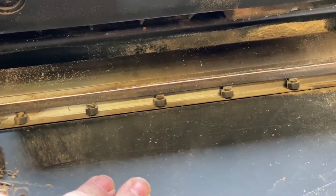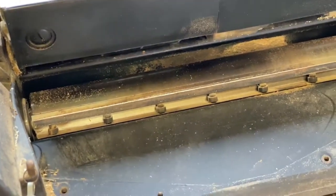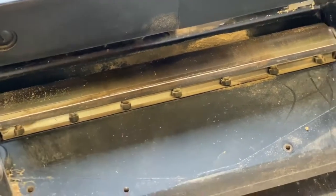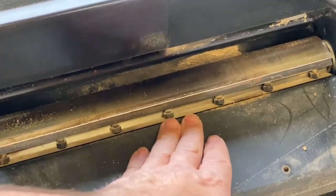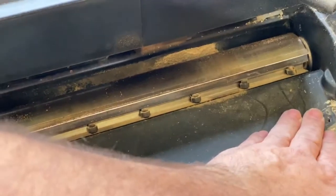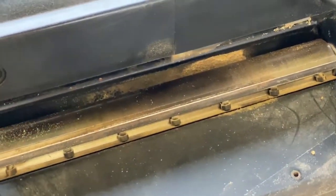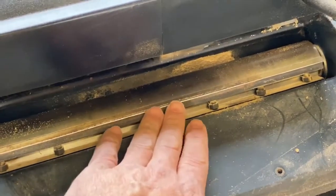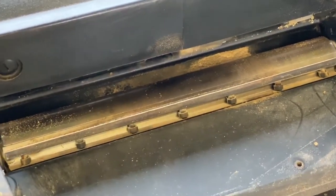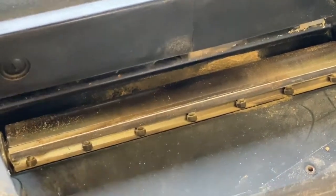And this is where potentially when you're sliding wood through the thicknesser, you probably should slide some here. Especially if you've got thin strips, don't always push them through the middle. But do one here, one here, one here, and just keep the process going just to maintain the wear on the blade. Otherwise, if you just put it in the middle all the time, you're just gonna have the constant wear. Obviously, if you're doing a wide board, that's a different story.